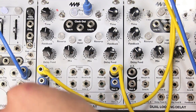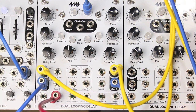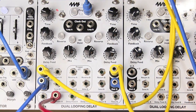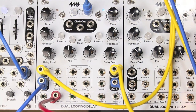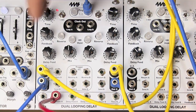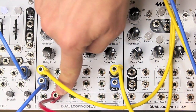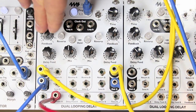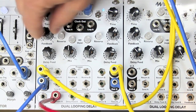You can also control feedback with CV, and this is really interesting. If you turn feedback down, no matter how much CV you give, it's only going to go to 100%. But if you turn feedback up a little bit, you can get it to go to 110% with external CV. This is useful because it limits how far the external CV can modulate feedback — so if you want to stay safe and not get into 110%, keep the knob down with any CV.